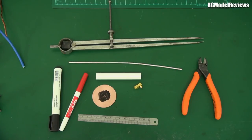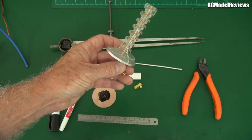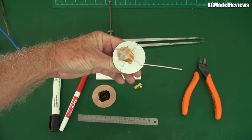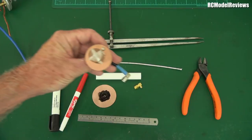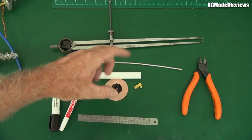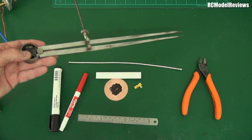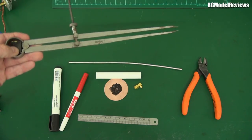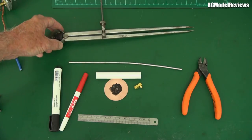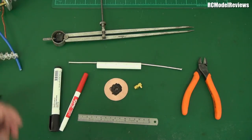For the back plate reflector, I'm using a piece of circuit board - Circular Wireless use a turned aluminium piece, which is very strong and rigid, but aluminium is hard to solder to. You could even cut the back off an old bean tin as long as it's nice and flat and cut to the right size. I've drawn a circle with a compass to get the 52 millimeter diameter and filed it to shape by hand.